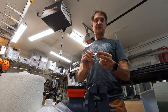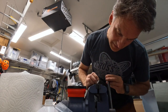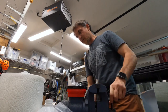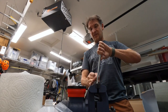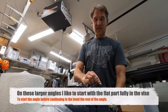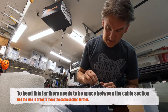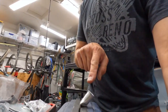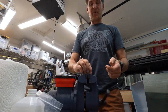It's almost 90 degrees — we'll do about a 70-degree angle right about there, that's going to be a good bend. I need to make sure when I set this up in the vise that I give myself plenty of room for it to bend down. I don't have to heat this up, but I could. I'm going to take it down right to the lug section — that gets me to about 45 — so I need to go quite a bit more. I'll give more space and tighten that down. My bending rod lever arm gets about a 60-degree bend.